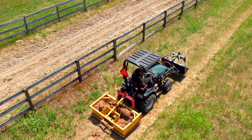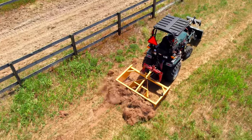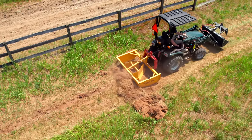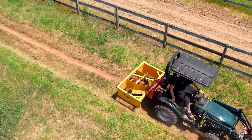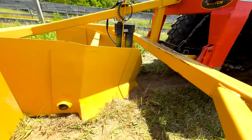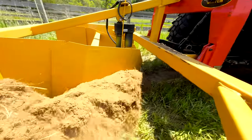And you don't have to take all the meat in one bite, so to speak. You can adjust this, and on a lower horsepower tractor like the Summit for this tool, it's good to start gradual, right? Just take off little bits and make multiple passes and you get where you're going. And so for this total little project that we're doing, it's 500 linear feet. I added it all up on the Google Maps. 500 feet that we did, cleaned this stuff all out in 30 minutes flat.